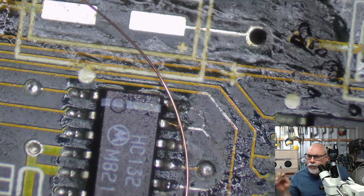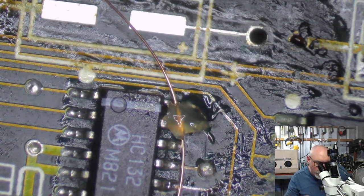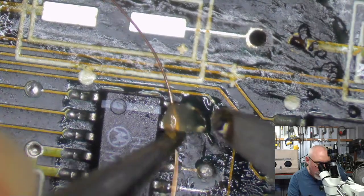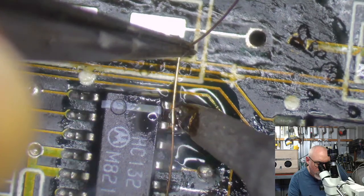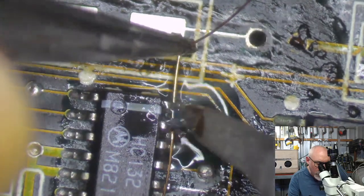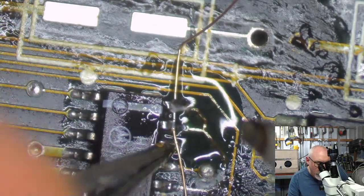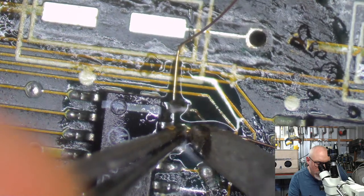Okay, can you do Command Option Shift Delete SCSI ID? Have you ever tried that, Mr. Fahrenheit? Because I sure have. It doesn't seem to work for me. I don't know if I'm doing something wrong, or maybe it only works on more recent Macs, but I have never been able to get that to work for me. So certainly not on the old Macs, like an old SE/30 or something like that. Yes, that is what it's meant to do, and what they say is you hold down Shift Option Command Delete and then the number of the ID you want. I have never been able to get that to work. So if you know some sort of magic trick for getting that to work, please do share it.